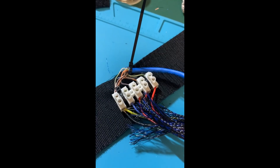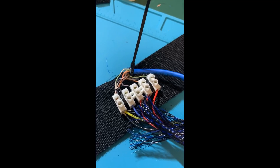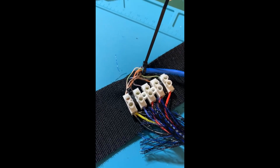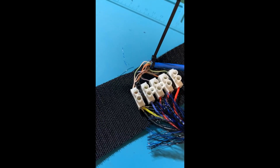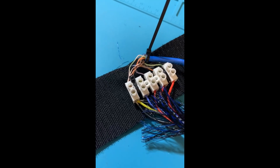Now I have the cables coming out of the comms cable — the cat 5, or I guess it's cat 6 cable. One color per finger, and then all of the white-with-color-stripe ones will go to ground. As I mentioned earlier, if you want to keep your ground separated, you would put on an 8-count terminal block rather than the 5.